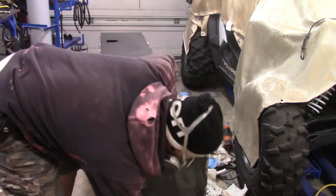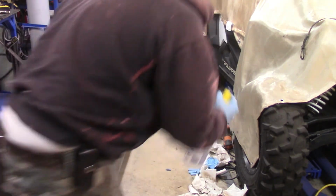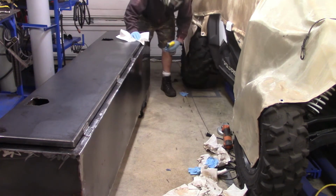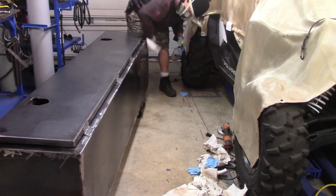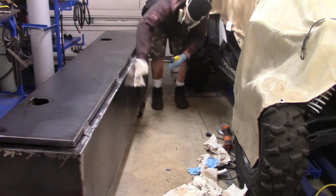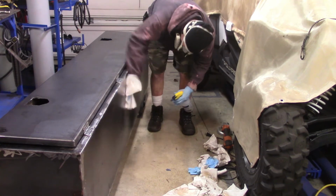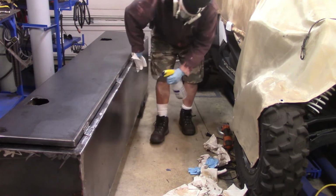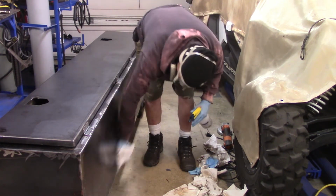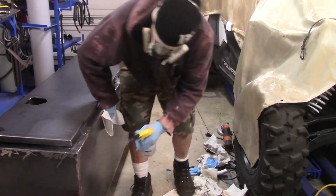At this point, I had tons of rags on the floor. Acetone has worked really well for me when it came to pre-paint. It's a nice pre-paint product to use, I think, for steel. Eastwood has a product too, I think it might be called pre-paint cleaner or something. I really like it. Thing is that they're about $6 or $7 a bottle, and you can get a whole gallon or more of acetone that would last a lot longer.